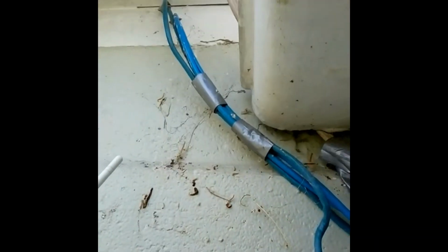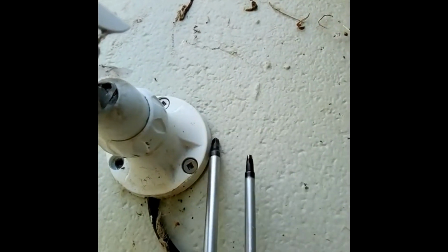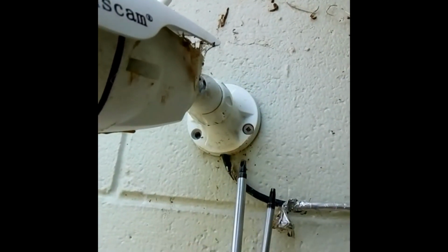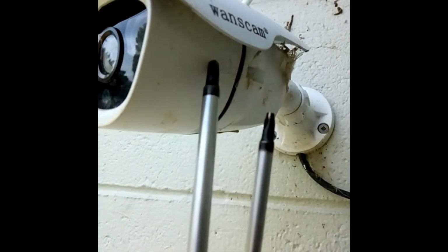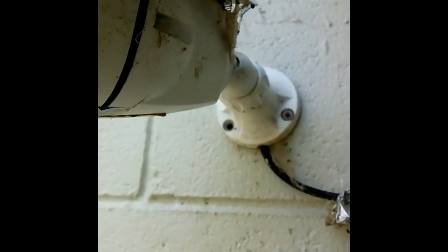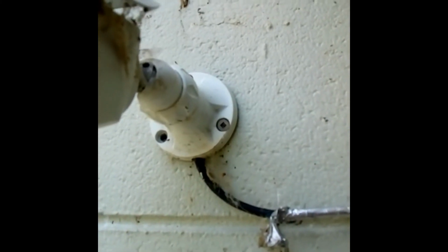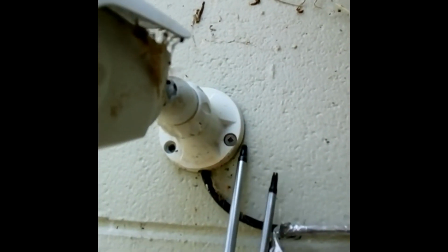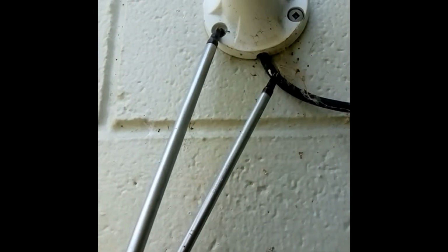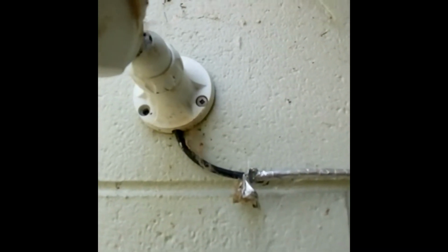which might lead, despite the fact that there's some roof and guttering, to rainwater coming in here and evaporating and then going all the way up here, because that's where the cable goes in, and then corrodes the camera inside. We had that unfortunately quite a bit, and because of that we always put a bit of vinyl underneath here, and of course we want to have three screws in, not just two. Cool, so I will take that off.